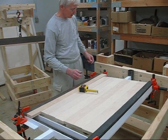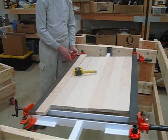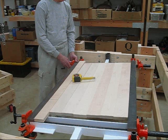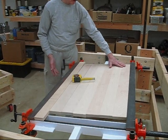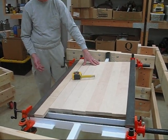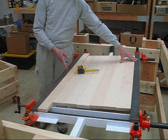I need to have my horizontal clamp extend approximately one-half inch beyond the front edge. That means it has to be 26 and a half inches between this edge and this edge. My six pieces of wood making up my work piece are 20 inches, and my two spacer bars are two inches apiece.